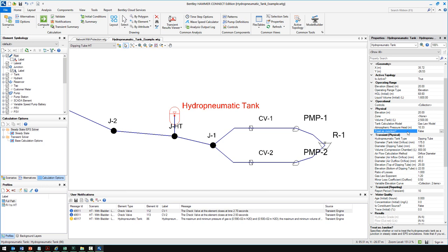For a 24-hour EPS simulation with a one-hour time step, you can have the hydropneumatic tank fill and drain even during an EPS. The problem is these tanks tend to fill and drain quickly because as you add water, the decrease in gas volume produces a relatively large change in pressure. You usually need a smaller time step to capture those changes; otherwise it could overshoot your control ranges and give strange results.